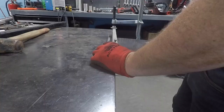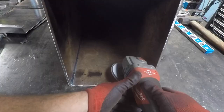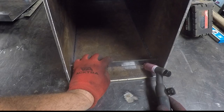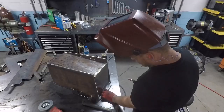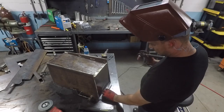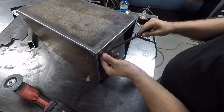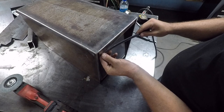I'm cutting the door out of 16 gauge also. I'm going to put a couple bends on it for a handle. One-inch flat stock gets stitched to the top of the box as a stopper for the door, and magnets will hold the door closed — magnets get glued on after the entire box is painted. I clamp the door to the top of the box to ensure a tight fit, then stitch it. It ends up being a little too tight so I have to take some material off. I put grooved rubber around the whole door so no one cuts themselves on sharp edges, but also so that no water can get into the box.